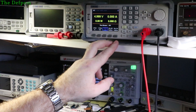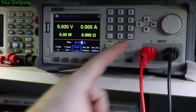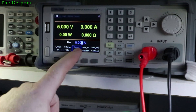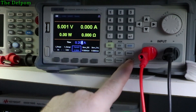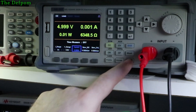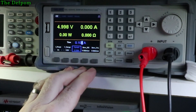It's actually 200 millivolts of noise and it's not even loaded yet. Let's try loading this thing up and see what happens. Something nice about this DC electronic load is the decimal place control, though when you turn the load on or off and try to dial it, it jumps to the least significant digit, which is a bit annoying. Bit of a firmware quirk that they should fix.